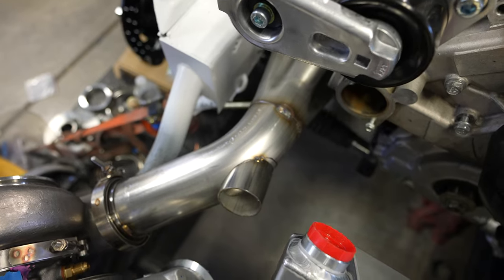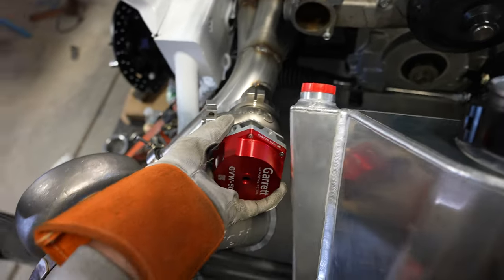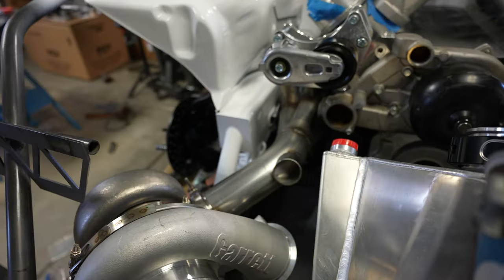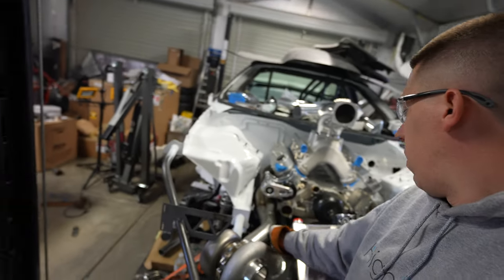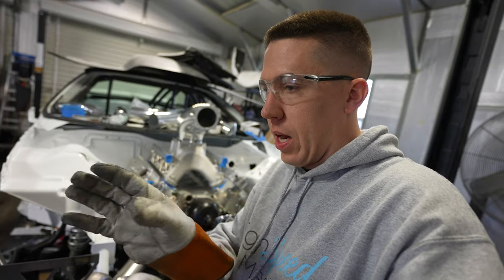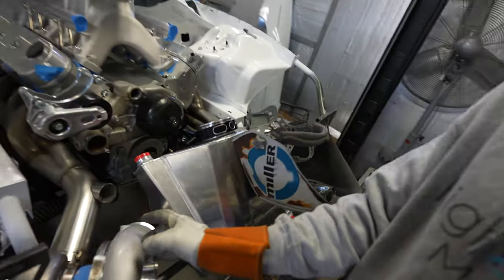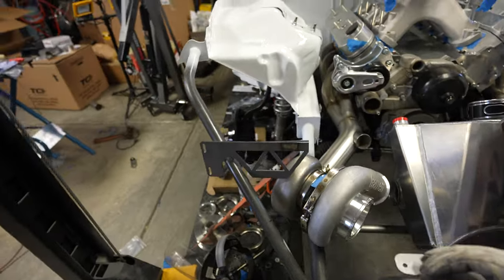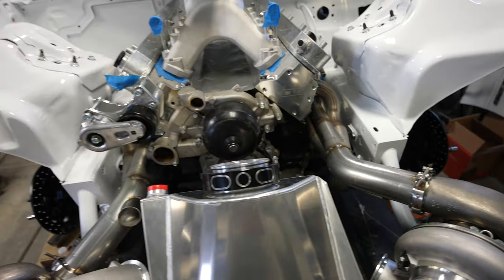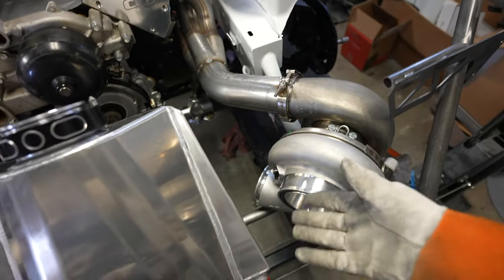Let's see if we can make this work. Got a little tack on there — it's pulling it up a little more than I like, but it gives you guys an idea. It's a little tight there so I might try to favor it over just a little bit more. The line of sight into the rest of the exhaust looks really, really good. I'm trying to decide the best route — probably pull it off and scribe a little line in there, peel it off, grind it, weld it, and then put it back in. As long as whenever I'm welding everything I make sure it actually gets tighter and more into the engine. This side is up next. We have a little bit more room since the intercooler has this on this side and is down here on this side, so we gain a little bit more room in this area — this side should be easier, just like the cold side was.